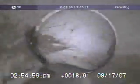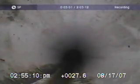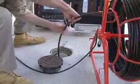The camera shows you the type of pipe, clay, cast iron, or plastic. It shows you if the pipe is cracked or clogged with tree roots. Push the camera ahead slowly, taking care when negotiating a corner or coming upon an obstruction. Once you see the trouble area, now it's time to locate it.